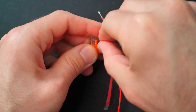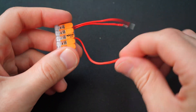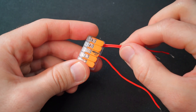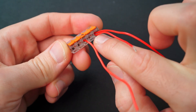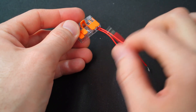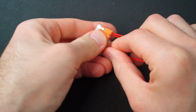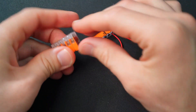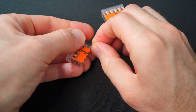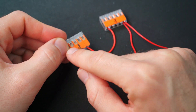Just keep going for as many wires as you need to ground — pop it in, close it down. If you need to ground more than five components and you've got all five slots maxed out, you can daisy chain. Take a wire, put it into the full lever nut, latch it down, then grab another lever nut, pop that wire into the new one, close it down — and now it's daisy chained. All of it will be grounded, and you have four more additional lever nut holes for more wires.